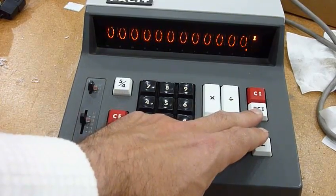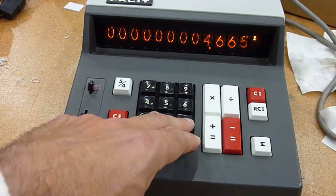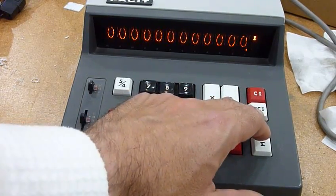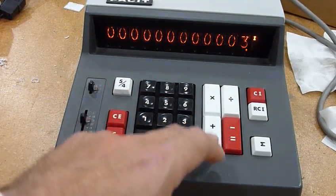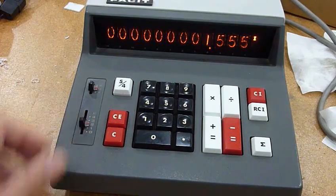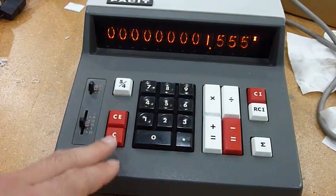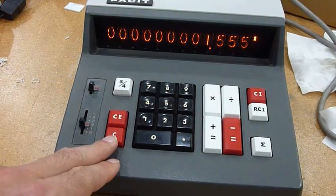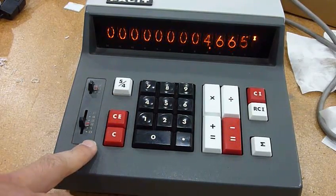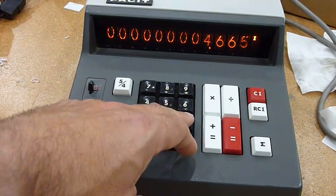And now the mysterious 5-4 — that's the rounding key. It was hard to make it work. So I'm in 3 decimals, and if I divide this number — carefully choosing the number — by 3, it's going to give me 1.555. Now if I go to 2 decimals, we'll see the rounding in effect. So the 5 is either going to be cut off, or be rounded up and cut off, depending on the position of that key. So I enter that number with 3 decimals while I'm in 2 decimals mode, and it gives it back to me in 3 decimals again — so that's convenient.